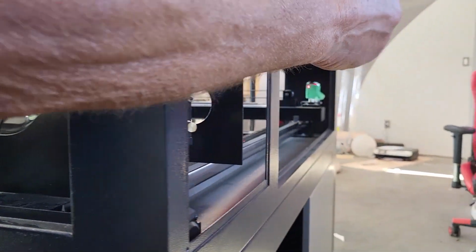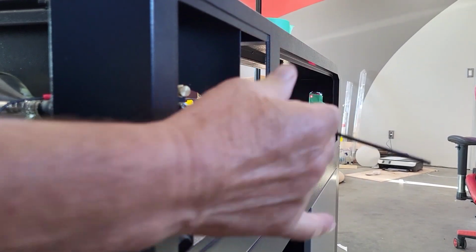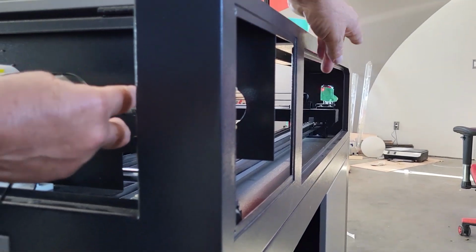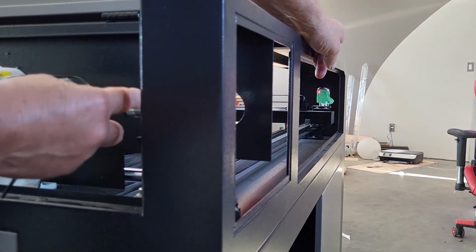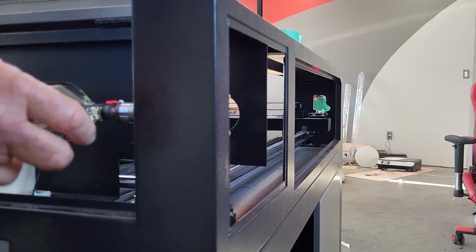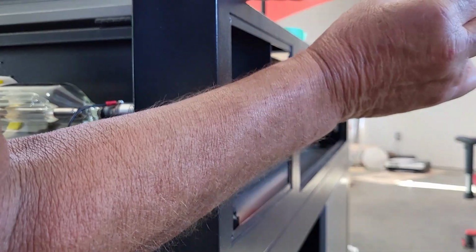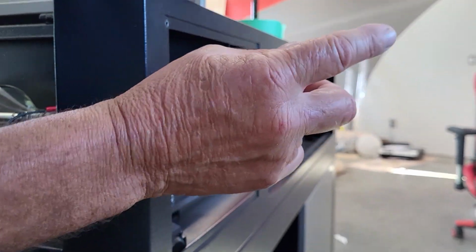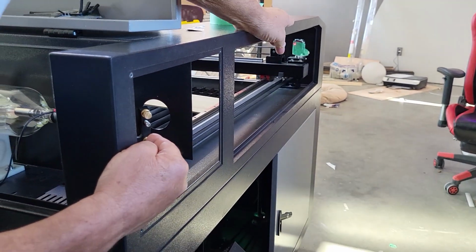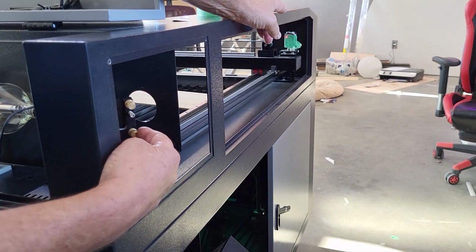Now we managed to get it lined up to the center of the pulse mark. We're not moving any mirrors. All we're doing is aligning the red dot pointer from the four screws. We got the red dot on the pulse mark, which makes it very easy now, because instead of aligning your mirrors and keep pulsing and pulsing and pulsing, I'm going to bet that all I need to do now is adjust my mirror. So I need to go right.